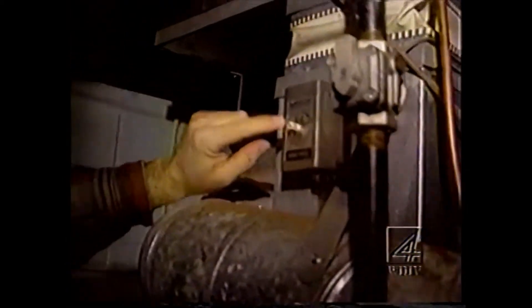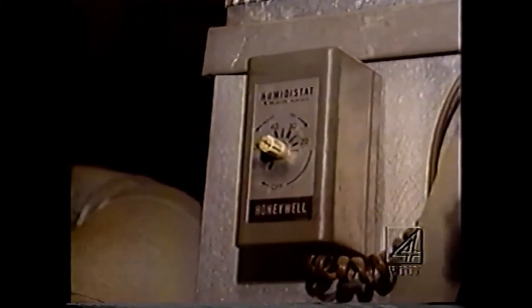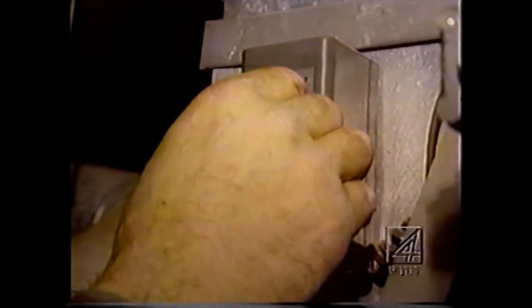We're going to turn on and make sure the water supply is turned on. These little valves — sometimes when they're out like this, they're on; sometimes when they're in, they're on. So you're just going to have to check it, turn it on, and then check it. Now this is going to be our humidistat. We'll keep it pretty high because people don't usually come down and mess with their humidistat. I usually keep it between 40 and 50 — I keep it up pretty high.